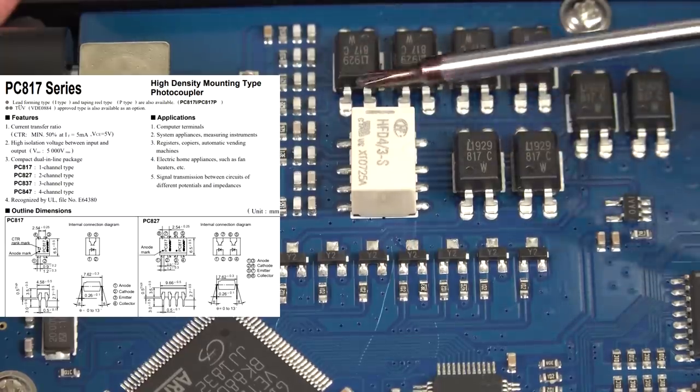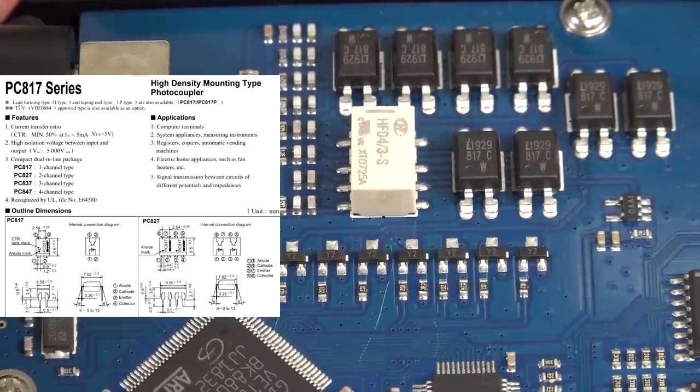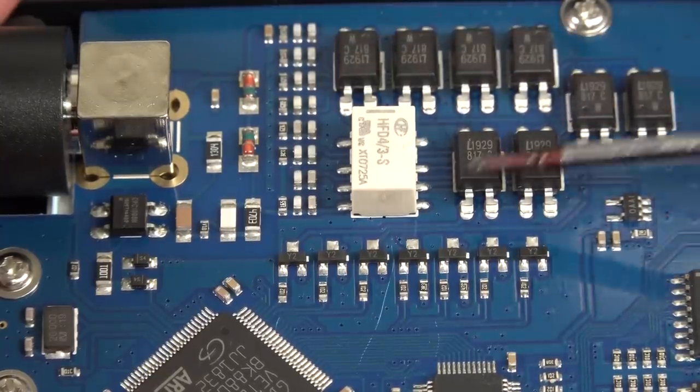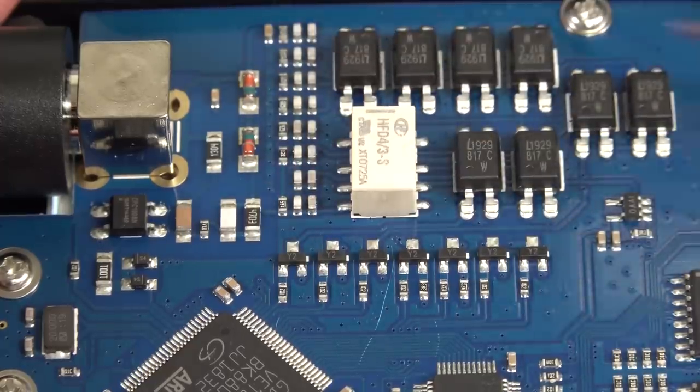1, 2, 3, 4, 5, 6, 7, 8. Oh, we got 8. Oh, what? Oh, there'll be one at the top end, of course. So yeah, it's tapping off all of those, and then you've got the input capacitance of these as well, upsetting the apple cart. And when you've got a huge, big divider like that, then you're going to come a gutser.